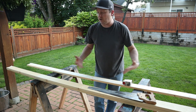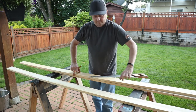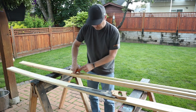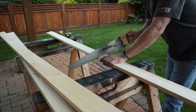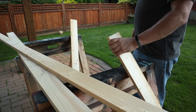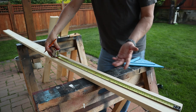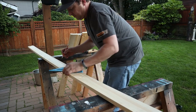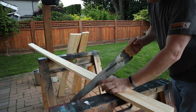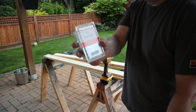What you want to do is cut two of these 1x4 pieces directly in half — they are 8 feet long so you'll have two 4-foot sections, so we'll just mark that up. With the remaining piece we're going to cut a bunch of 15-inch wide stringers. You can actually make this as wide as you need it to be. Do a bunch of these and those will be our stringers, and then we'll use one and three-quarters which we'll use to assemble the sides.